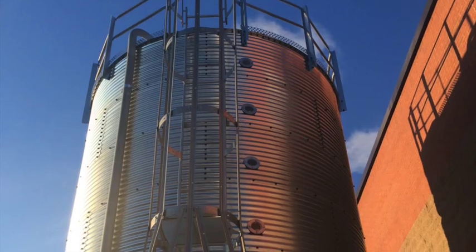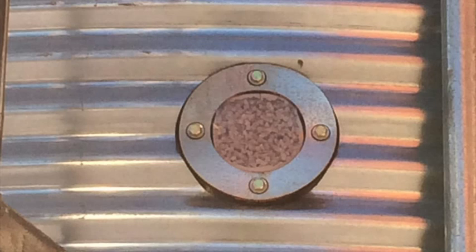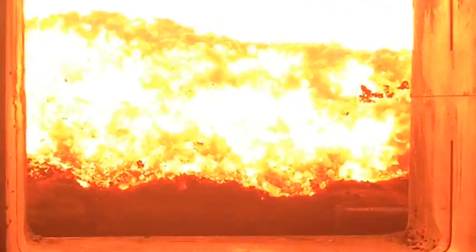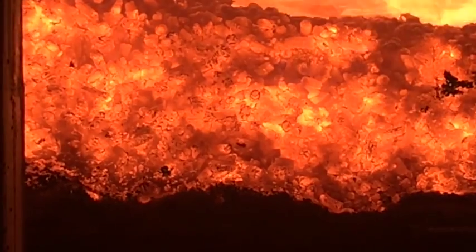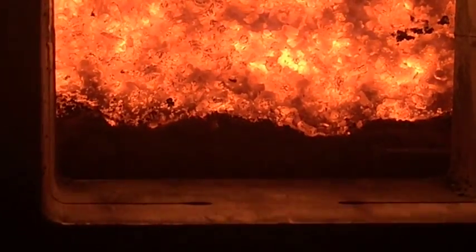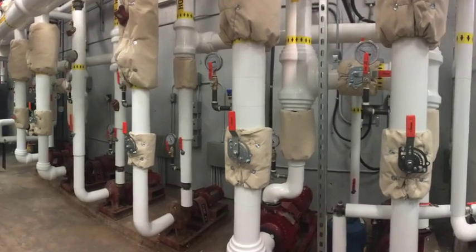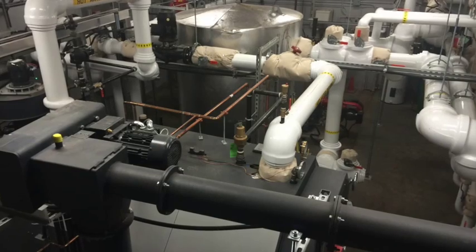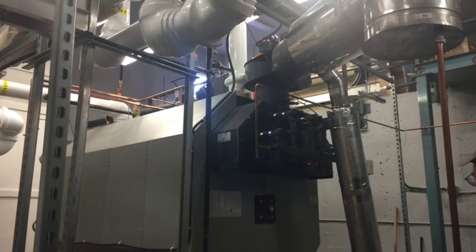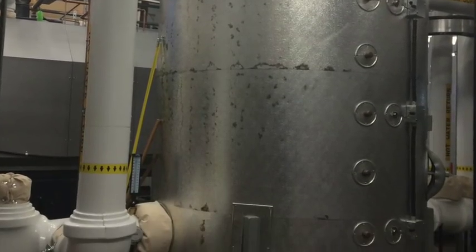So as this is running, to get a really clean burn — like your car — it has an O2 sensor in the back. It's actually reading what the oxygen level is during the burn, and it adjusts these flappers in here and this fan, adjusting the amount of air going into the burn. There are two flappers on the back that allow air to come up to the bottom. It tries to get to an O2 level of 8% while burning, and it sits at 8% for a perfect burn all the time. This is actually as clean as natural gas when it's burning.